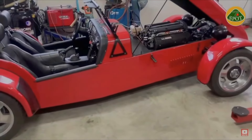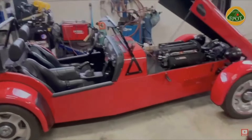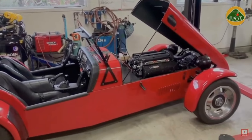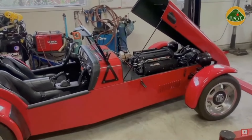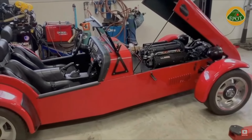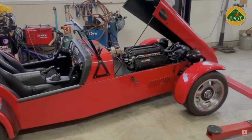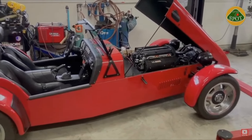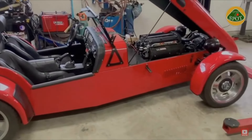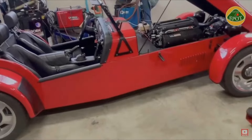The 6228 Aeropoxy is amazing stuff. Aluminum to aluminum, it has a tensile lap shear strength of 3,480 PSI, a tensile strength of 9,500 PSI, and a compressive strength of 12,000 PSI. So you're just adding a lot of structure and stability to your frame.